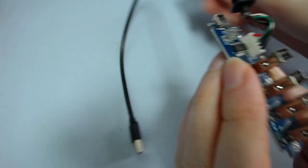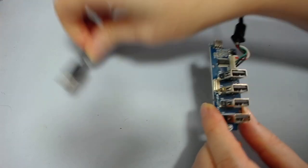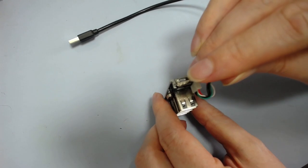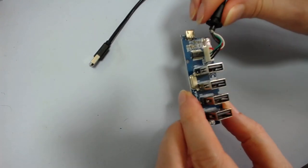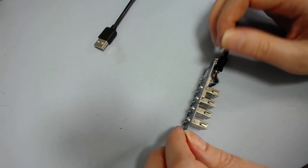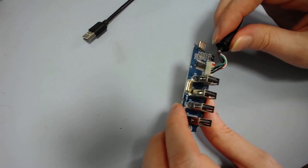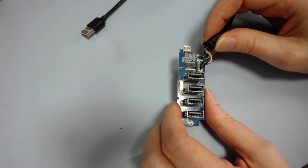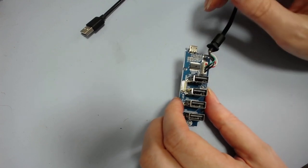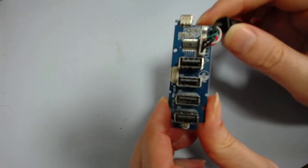As soon as I saw that I was like, well, that's why it doesn't work. And my second thought was, how on earth did that even happen? This thing has a USB plug and also a micro-USB which I think is for extra power — it might be meant to be a powered hub. It's not like the ones with a DC barrel jack where you could plug in the wrong power supply. Maybe it got plugged into one of those quick charge chargers and somehow got 9 or 12 volts instead — it looks like it's had a massive over-voltage or reverse voltage or something.